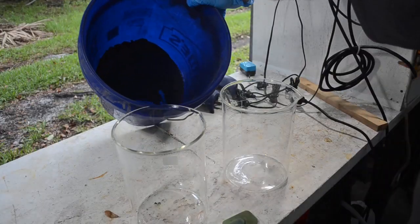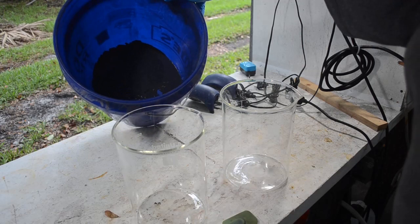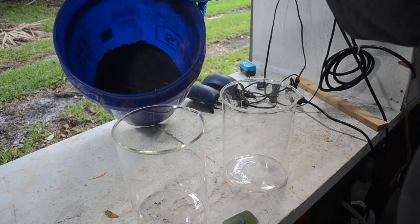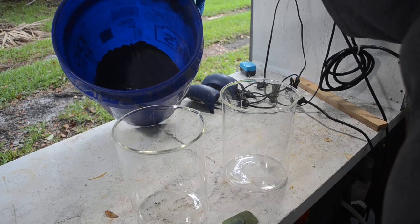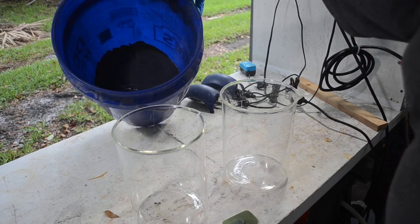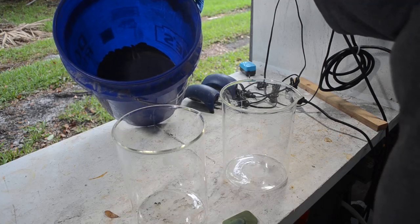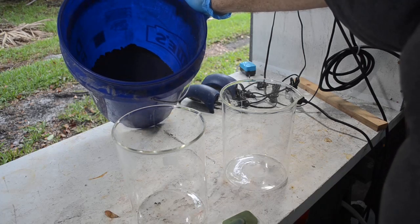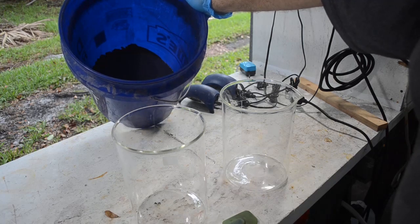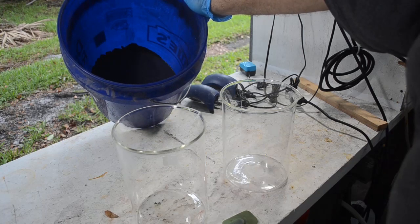I've got the concentrates here from the first gravity separation I did way back in part 2 of this series, when I processed the first half of Ken's chips after incineration and ball milling. I did a gravity separation and got these concentrates. And then in part 3, I did a couple of small scale tests on this stuff to see whether my idea of how to get rid of the steel in it was going to work, and whether I could then extract the gold without too much trouble. And sure enough, it worked in a couple of small scale tests. So I'm ready to scale up.